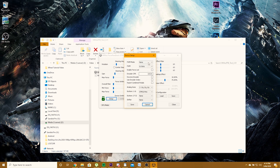You want to set it up. We're going to go PWM and direct mode, 16.8 kilohertz. CPR, we're going to have it 10,000. Now, use encoder index. We want this one, STM32 pins, DB25 shifter, analog XY. Now all this is on that same hackaday.io page. I'll post an image up of what needs to be done. But click save, yes.